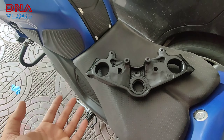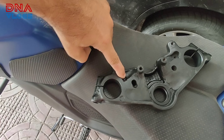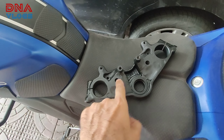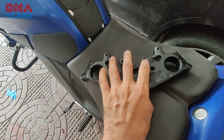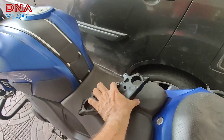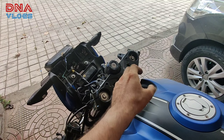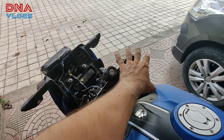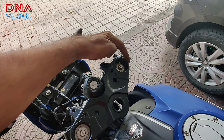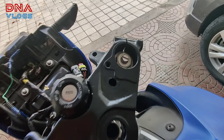I know M-seal is not going to stay that strong, but for you guys, if you can get it filled — the floor level is this bolt, at the floor level here is one edge. This is very shabby work in my case. I'm doing it for R&D — if it works fine, I'll purchase a brand new one. Remember: whoever does the filling of this part at the back side with aluminum, make sure it will not get too warm, because if it gets warm, the edges deform, they warp and turn inside, causing a fitting issue.